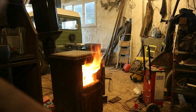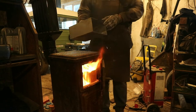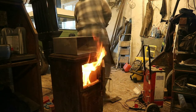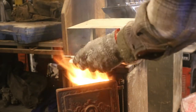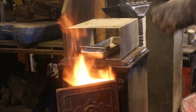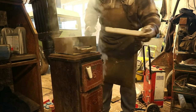Because for the moment I don't have an oven in my garage, I'm going to use the top of this wooden stove. I took the liberty to fill it with wood more than recommended so that I will get a higher temperature. I'm going to place this stainless steel case above it to create a little enclosure to hold the heat in. Inside it, my plastic mold will sit above a tray and any melted PLA plastic will collect and hopefully not start catching fire. I'm going to leave the plaster mold for three or four hours before using it to pour the aluminum in.